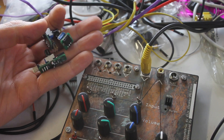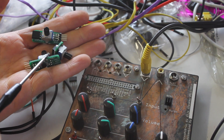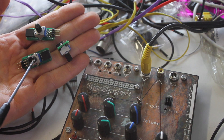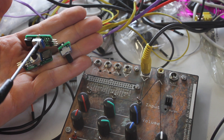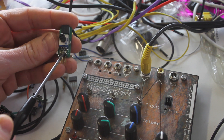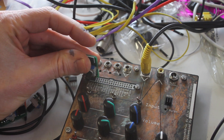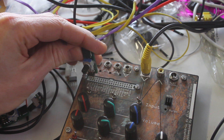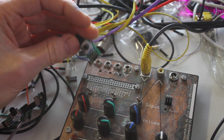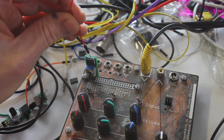I made a few new plugins. They are made as small as possible and we have a pot meter, a 10k pot, an oscillator square wave, and a comparator. These plugins have a chip on the back and they plug in only on the corner — you cannot plug them anywhere else because they need power, and there's also polarity, so you can only plug it in one way.